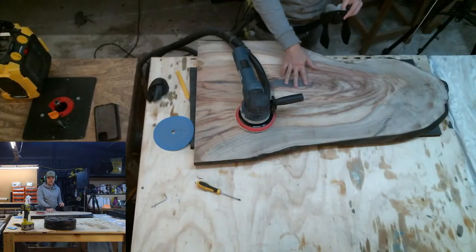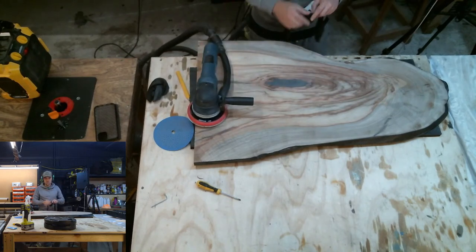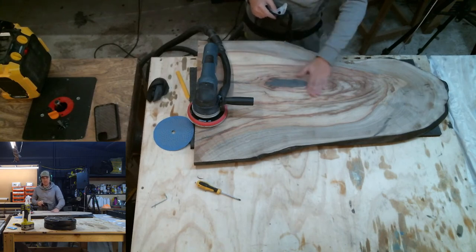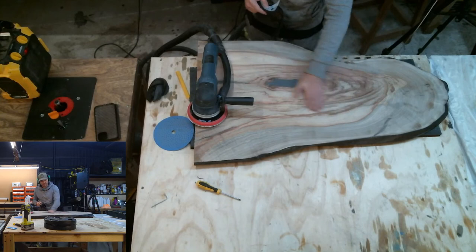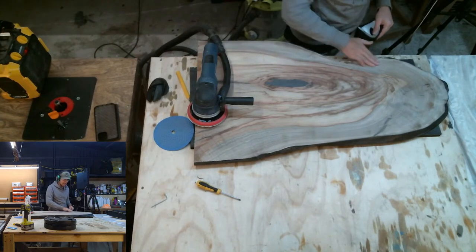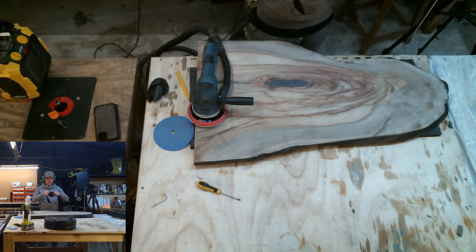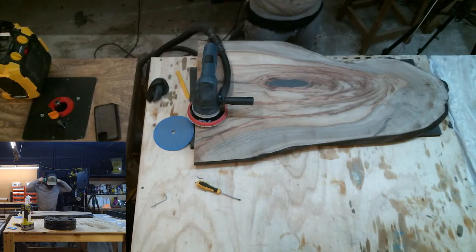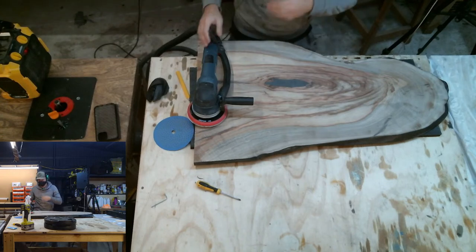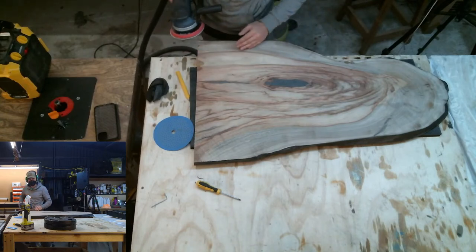The scratches are not forgiving with the polyurethane that we have. So we're going to use this polyurethane here, and then we might have to sand really high, maybe to 500 grit. But let's see. We're going to keep going with 120, because I have some spills from the other side. And then we go 120, 180, 220, and then 320. Anyway, let's keep going, guys.